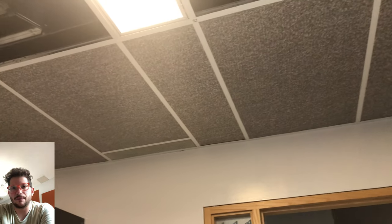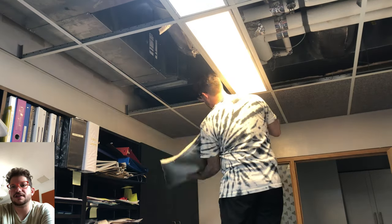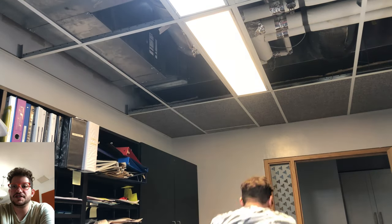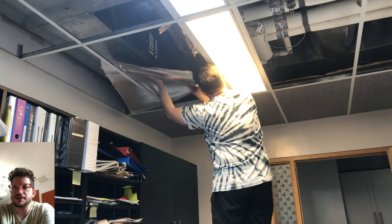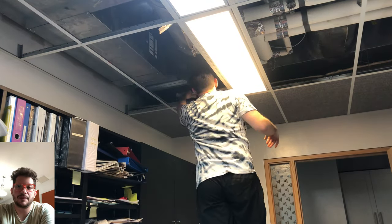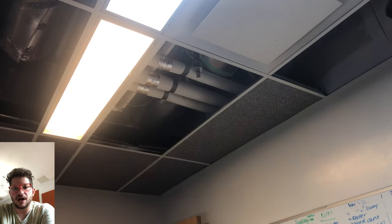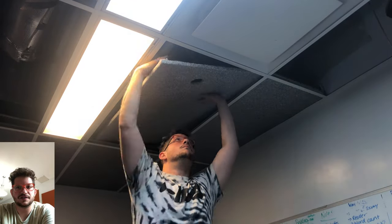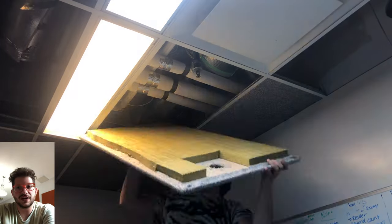You can see it's a much nicer look with better acoustic performance, with that acoustic insulation on the backside. This thick fabric also offers at least a little bit of deadening on the inside of the room as well. You can see me putting just a flat section of that mass-loaded vinyl with the acoustic insulation on top, just where the flat parts of the HVAC machinery are, where we can't wrap around that section — just to get another layer of mass and density to help stop that HVAC machinery noise from coming down above the workers' heads.